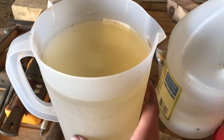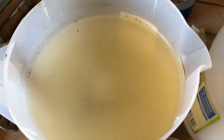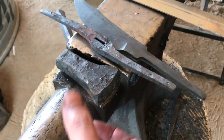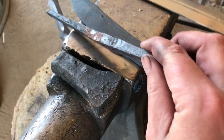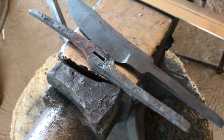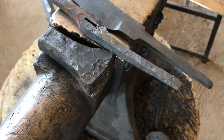Here's my tub of vinegar. I got to heat it up so that chemical reaction works faster. You can also leave stuff that's not finished, like this pommel, this guard — this one's not done, I've got to forge it a little bit more — but just take all your stuff that's got scale on it and put it in hot vinegar so it actually eats the scale off. It's a little easier on your files and your belts.